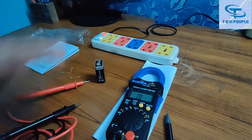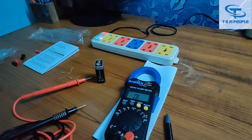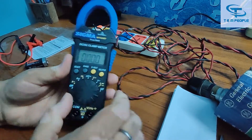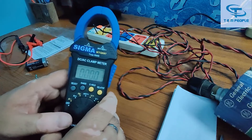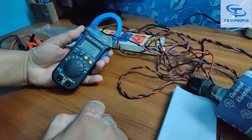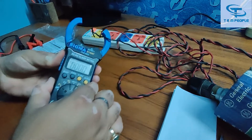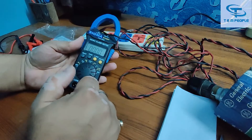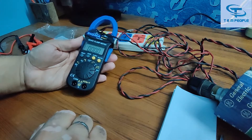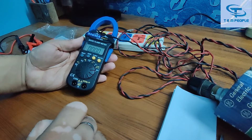Now we move to the main part — AC current and DC current measurement. I have a bulb on AC. When measuring AC current, you can clamp on any wire. The jaw size is 24 mm. Press both jaw trigger points to open the clamp. For AC current you can use either wire, but for DC current you must clamp only the positive terminal wire, as that is where the current flows.